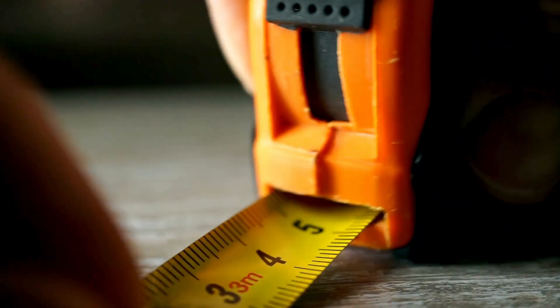On the other side, it's worth breaking out a ruler and looking at approximate sizes. If you have your sketch on one side of your desk, have a ruler on the other and start picturing the actual volumetric dimensions you're trying to achieve — length, width, height. If people are going to be handling it, consider that too: is it going to be too small to grip? You need to approximate the overall feature size of anything critical to the application before you get into modeling, so you have a good baseline to establish your model on.